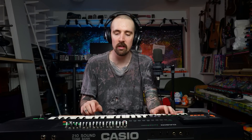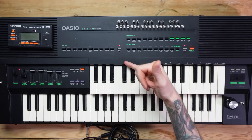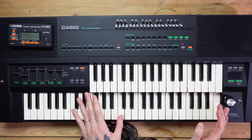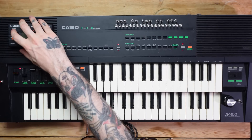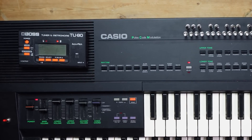The second reason why it took a long time is that when I had put everything back together, of course I had to tune the lower keyboard. It turns out, with the wiring going from a chip somewhere around quite literally the center of the keyboard — with wires from the original coil going all the way to the switch and back — that distance made it so I cannot, on the original coil, tune it back to a C being a C. So now a C is a G, I think. Not really even in tune. Interestingly, when I'm bending the PCB to put it back and screw it in, that's different from when I have it up, so you can hear it detune when you bend down the PCB to place it. Really, really fascinating stuff.